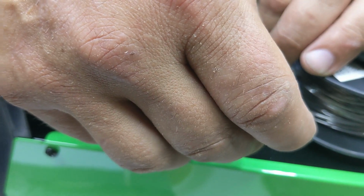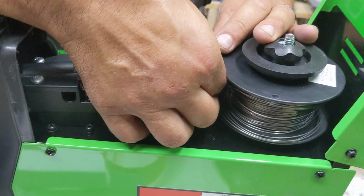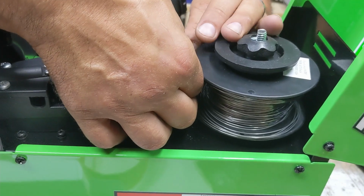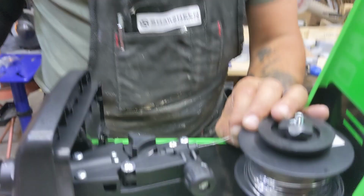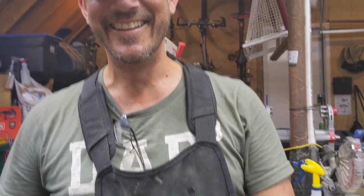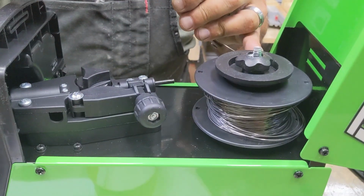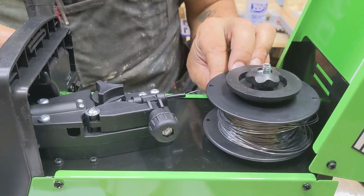There's this concept amongst welders, not welders the people, but welders the machines, that talk about the duty cycle. The rated duty cycle for this particular welder is 3 minutes. So we have to wait like an hour after using? No, you can rest for 7 after that. You can weld for 3 minutes, and then you must rest for 7. So 3 out of every 10 minutes can be spent welding.